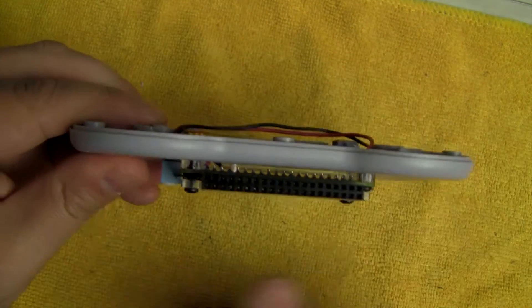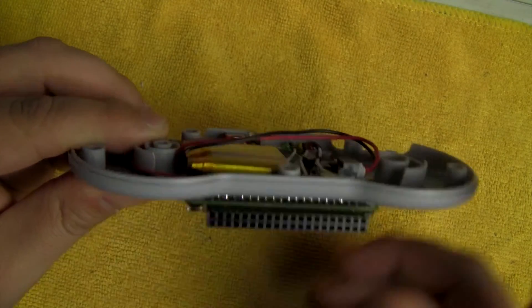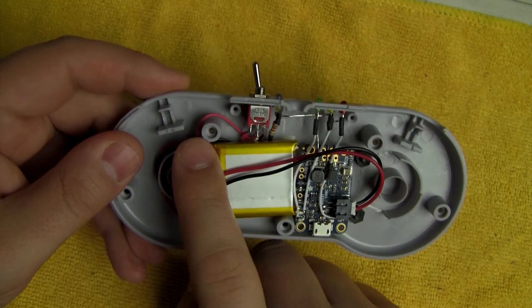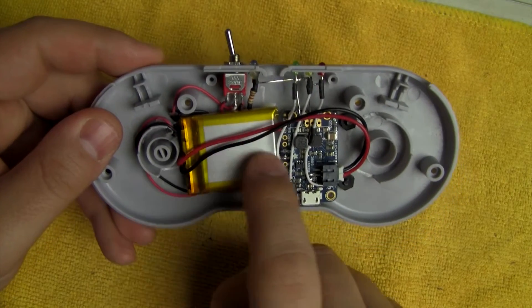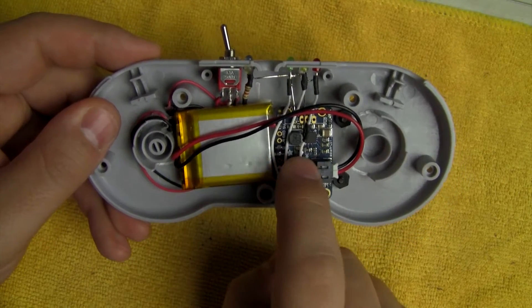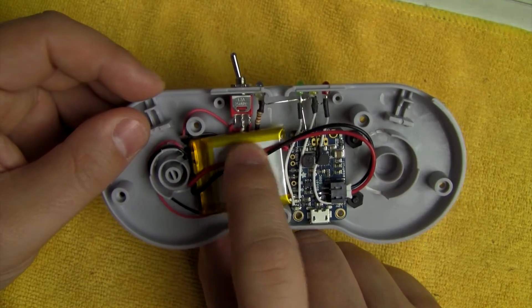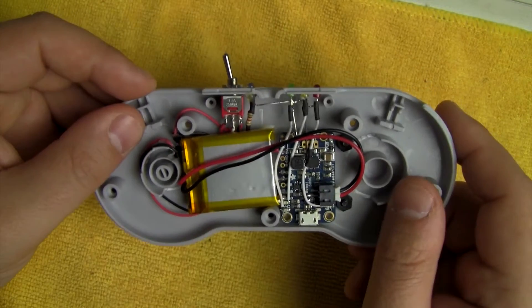The wiring is pretty simple. I've got two wires coming off the header — red and black, that's 5 volt and ground. The wires come through a hole behind the battery, run up to the DIP switch, through the DIP switch, and then the 5 volt runs up to the switch on top while the ground runs directly over to the booster/charger. The top two lugs on the switch are the enable and ground coming off the booster, and in this position it shuts the booster off.